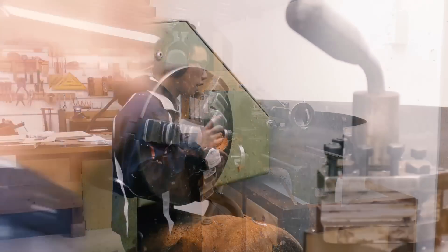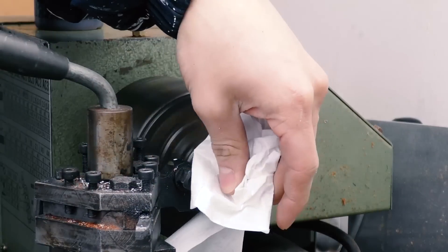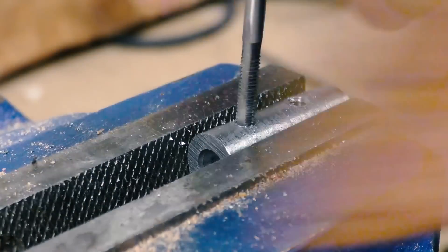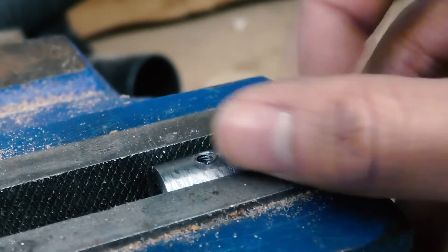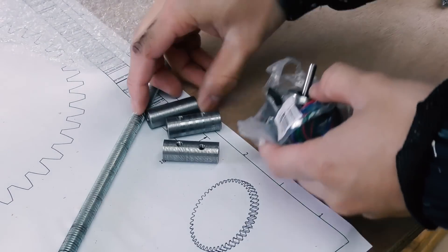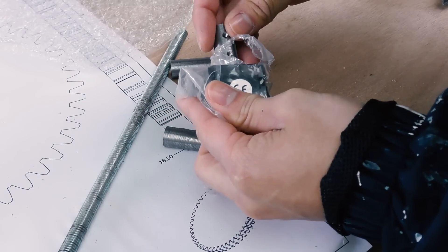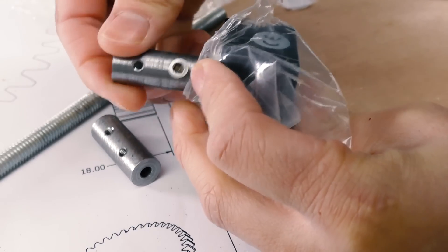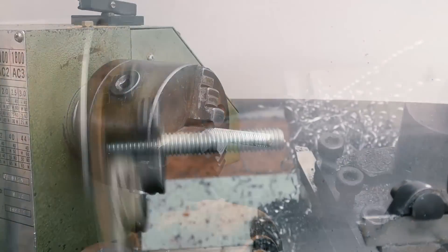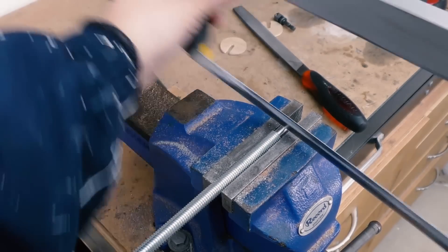As you can see, this is a part from the sliding table saw attachment. Before that machining, let's see how well it actually fits - oh yeah, it's quite good. Pretty good set screw. Now turning the threaded rod - I'm just trying to knock out all the metal parts now since to me they are the most difficult parts. I am making a mark and finding a flat spot for the set screw.